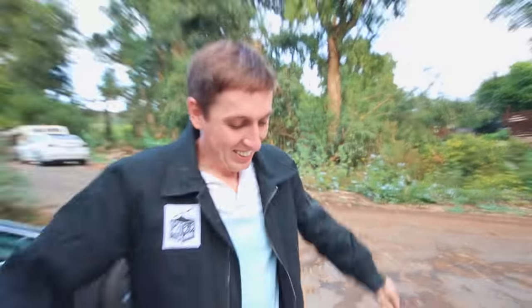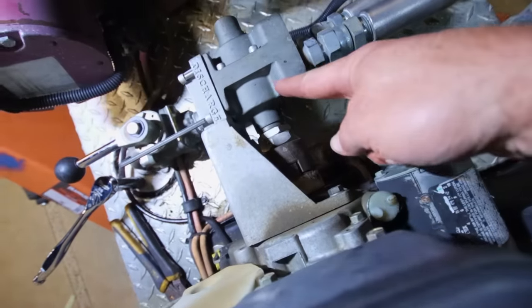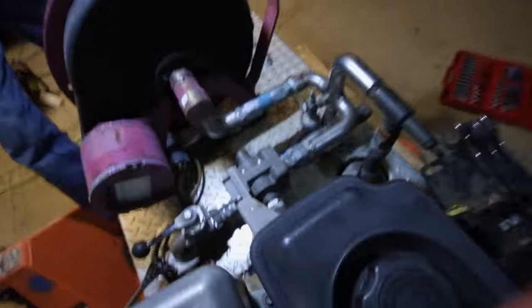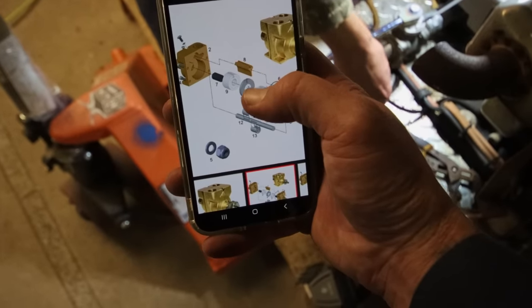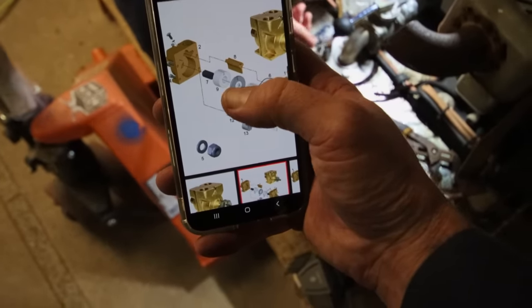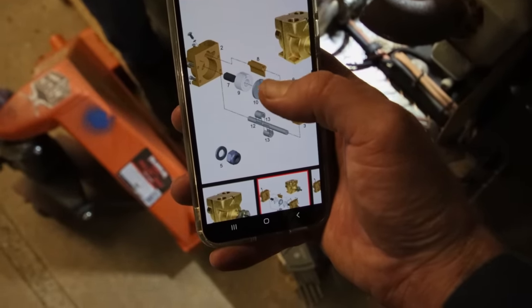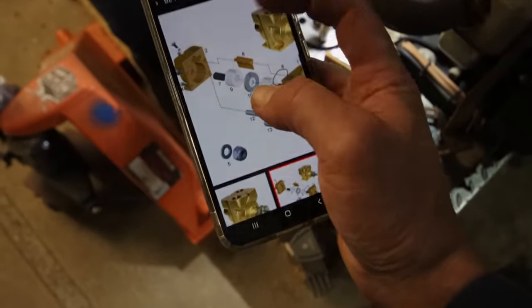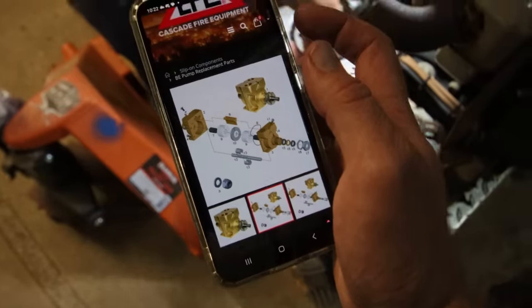What pedal are you pressing today — gas or brakes? We think we found the problem: right there is the coupler between the engine and the pump. The engine's running, that's the pump, but nothing was happening — no water, nothing. The way it works is there's a vane and two eccentric white blocks and a shaft. The shaft rotates, the white blocks go up and down, the vane keeps things engaged, and it squishes water between the two halves of the pump.